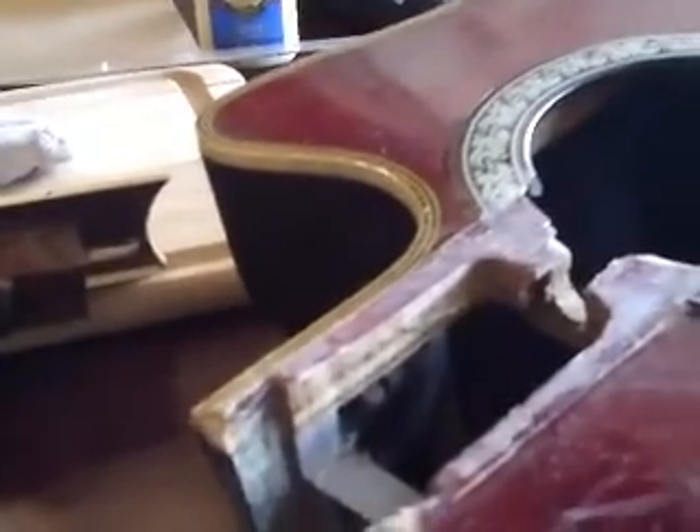Some people had been successful in getting it out, so I thought I'd try, and it wasn't hard. I've seen other people say that it wasn't hard for them either. I used a cappuccino machine with a hose and needle — like a needle for filling up a basketball — clamped onto the fretboard extension to heat it up. I also used a little propane torch heating up a utility knife so I could slip it underneath the fretboard extension and gradually melt the glue. That popped out pretty easily. I was surprised, considering it's epoxied in, but apparently they used a special epoxy or just not very good epoxy.